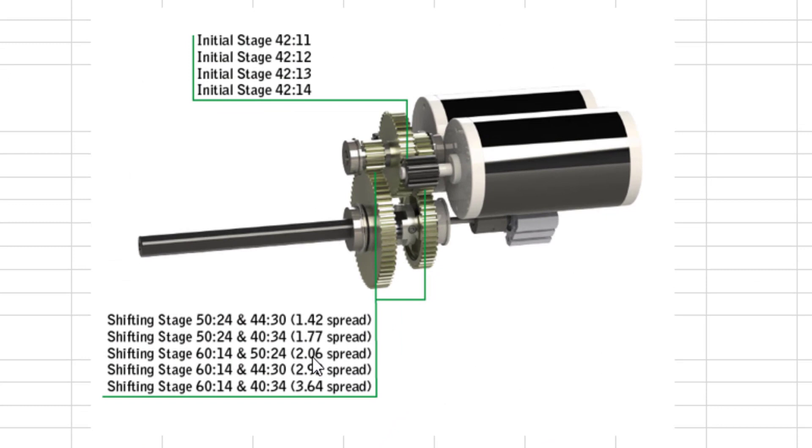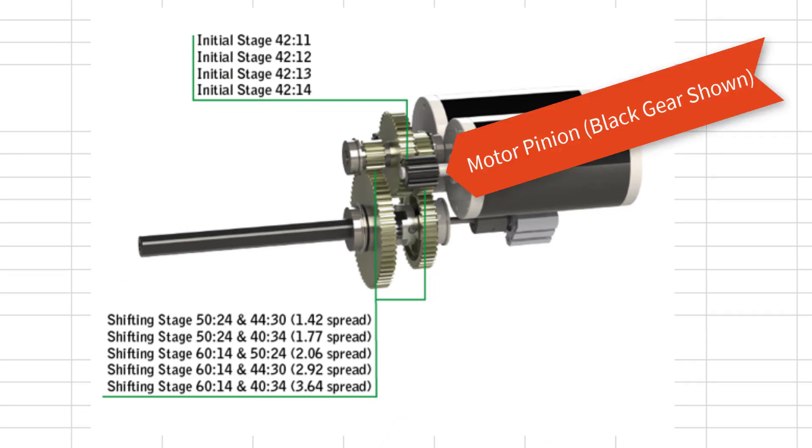Input Initial Reduction. The size of the first gear is uniform across the two or three motors in the gearbox, and the ratio from these motors to the first stage gear is important. The numbers in the ratio are numbers of teeth on the gear and determine whether the ratio will have more torque or a higher speed. If the number is smaller, that means the larger gear, with more teeth, will spin fewer times per revolution of the smaller gear, but will have more torque. Vice versa, if the larger number is first, the smaller gear will spin more per revolution of the larger gear, but with less torque.